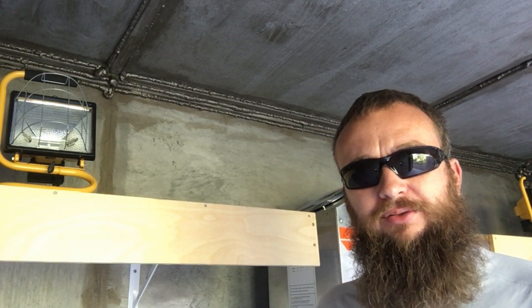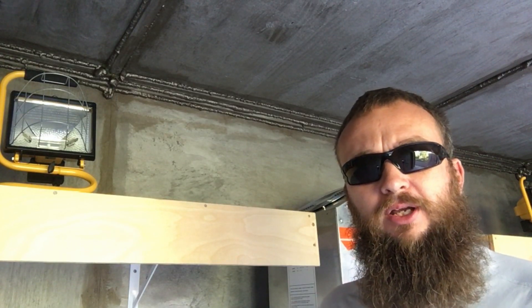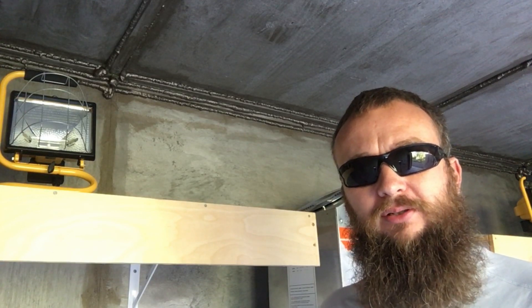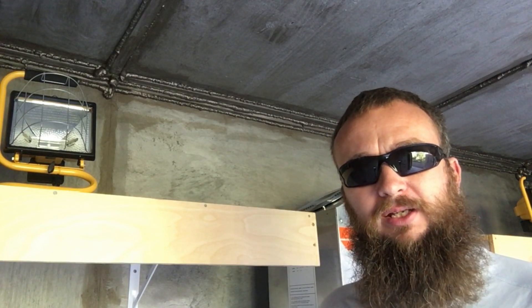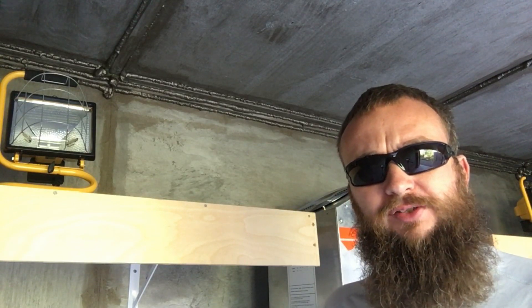The second function of these lights is the final stage where you sterilize the wood. When you're done drying your lumber and it's down to 8 or 10 percent — whatever you're looking for — your last 24 to 48 hours is when you do your sterilization. You want to get that kiln temperature to at least 150 degrees. Some people do 160 degrees; I'm going to shoot for 150. You cut the compressor off the kiln because the compressor won't run past 130 degrees regardless.